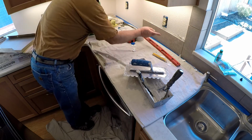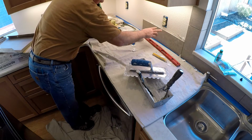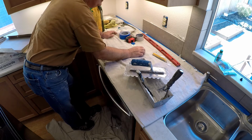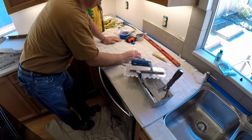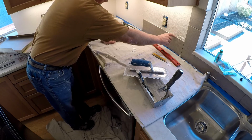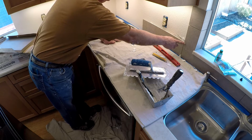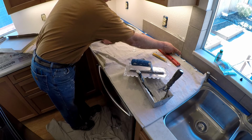So this wall, it's got a patch here, so it comes out here, and then it seems to concave here, and then comes back up here. So we'll make our next tile here that's going to have the cutout for the outlet. The mortar here is going to firm up by the time I get back to this, and these two shims are holding it right where I want it here. It's right where I want it there.